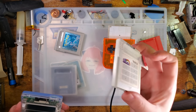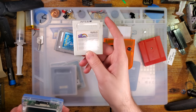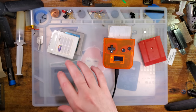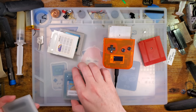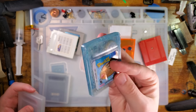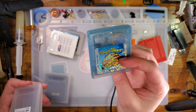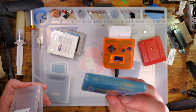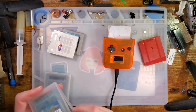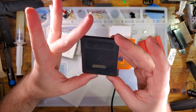It works exactly like you'd expect, but you do need to generate the ROM pack and map file for reflashing something like this. It's a little bit easier on the GBX cart than it is on here, but it works basically the same. Forgive me, I don't want to demo it because I don't want to wipe this thing. The AM29F option should also work on the MBC30 flash carts — just select MBC3 and ignore the MBC30. And then you can write to something like this; I've done videos on those. It should also work if you used a 4-megabyte chip instead of 2, but only on MBC30, not MBC3 — MBC3 only supports 2 megabytes.